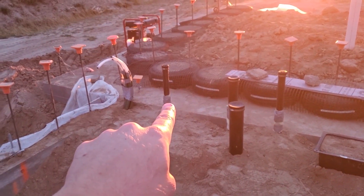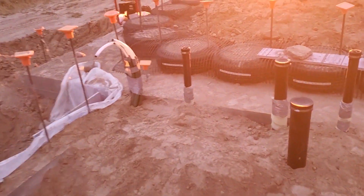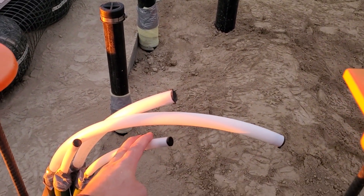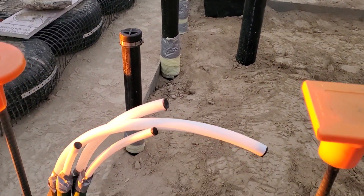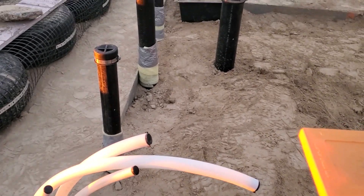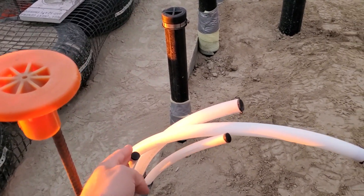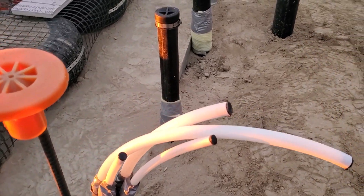Toilet, lavatory, and the various feeds to the bathroom. We've got a few different PEX pipes here. One of them is a gray water feed to the toilet tank, because gray water from our planter will be used to feed the toilet. Another one is for a hose bib at the front of the house — it's just half inch, but we're going to have a rainwater cistern, so we don't really want to be too egregious with our water usage if we need to pull water from the front of the house via a hose.